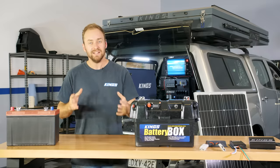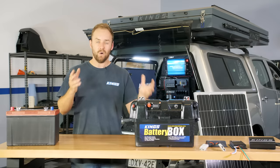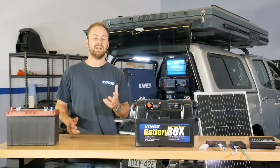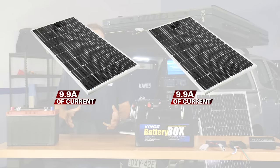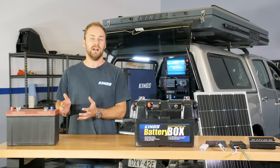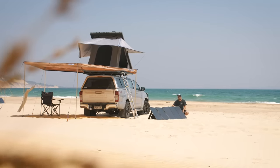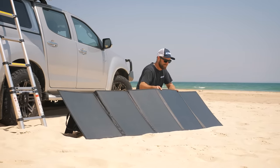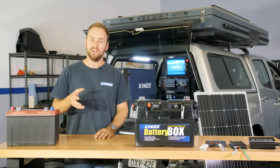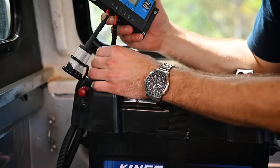There are two easy and relatively affordable ways to ensure you never run out of power: increase your battery capacity or your solar power capacity. With a single 160 watt solar panel you can expect about 9.9 amps — double the panels and you've got double the power, so if a storm comes through in the afternoon after only a couple of hours of morning sun, your batteries have still charged twice as fast. You could also keep your permanent solar running full time and set up a portable solar panel at camp, running both through the same regulator or DC-DC charger, or run the portable panel directly onto your battery with its own regulator.